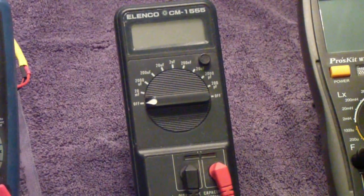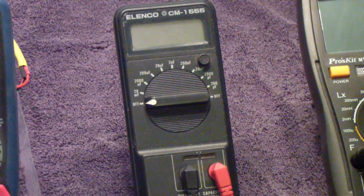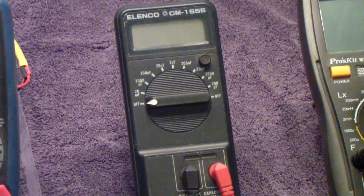Next to it is a straight capacitance meter — a unit that just reads capacitance. One of the advantages of this meter is it goes fairly low in capacitance but also goes quite high. That can be useful particularly if you're doing audio circuits, where they use capacitors of 5,000, 10,000, or even 20,000 microfarads. This won't go quite as high as a farad, but it will measure most audio capacitors used in output stages and similar applications.